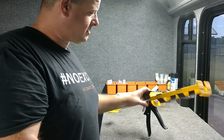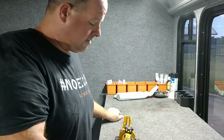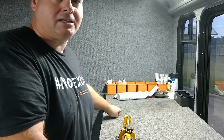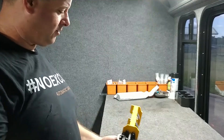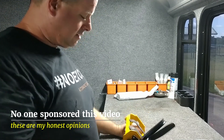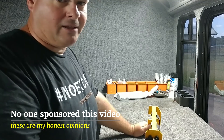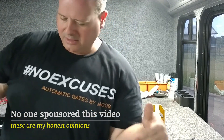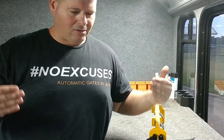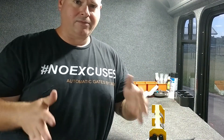This stuff has greatly improved installation time on loops. It doesn't require us to shut down gates for very long before they can actually start using it. It's remarkable how well it works, because when you buy your typical self-leveling loop sealant and you're dealing with unleveled ground, it's self-leveling for so long that it'll start to pool in areas of the uneven roadway.